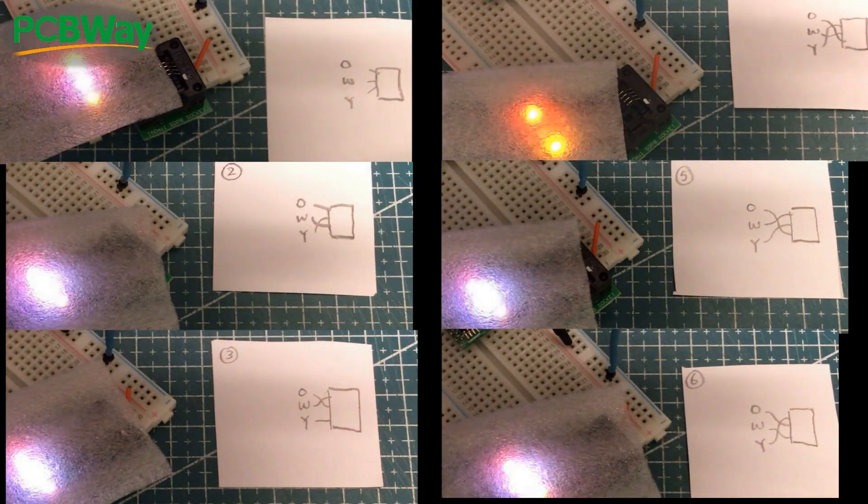I'm not sure what I've learned from this experiment. These are the six possible configurations with the different PWM channels. A couple of things emerge: one is the white light overpowers everything else. So I think I'm going to reconfigure the LEDs — I might make it orange in the middle and then two yellows on the outside, and that'll become a little less frantic.